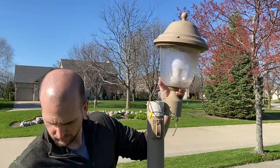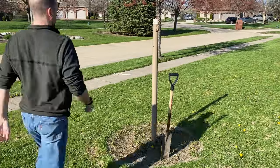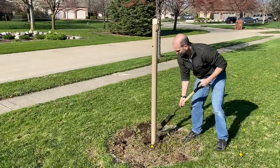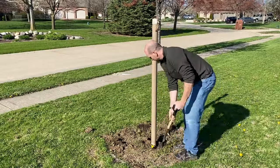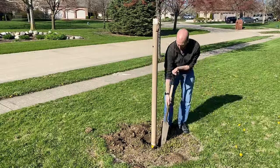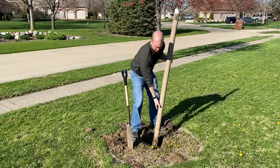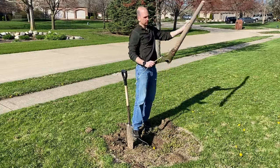If you're good to go, keep in mind: are you redoing this light fixture or installing a new one? If you're installing a new one, just remove it - don't take your time. If you're redoing it, obviously take your time. Same with the post - if you're just removing it, you can be a little rougher with it. Every installation is different; some will have a lot of quickcrete concrete in there, some won't. This one's pretty easy to remove. Get it out of the ground, then remove and slide the Romex out of the post.